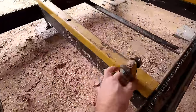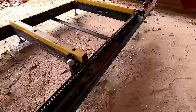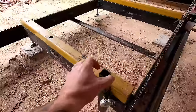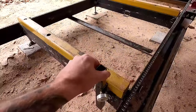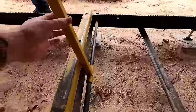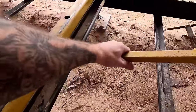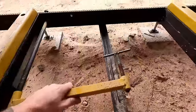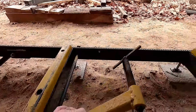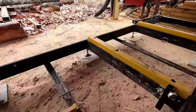We have an offset with a roller so we can roll the log over, and we also have a square stop for cants — squared-up lumber to screw against. Our log clamp rides on three-quarter inch steel tube, hollowed out, and it binds as you slide it over. Then you have a threaded T-handle made out of all-thread to dig into the log to hold it during your first initial cuts.